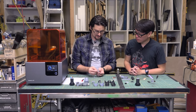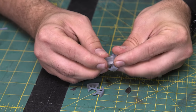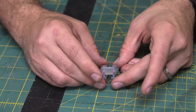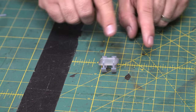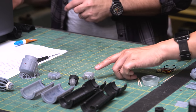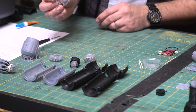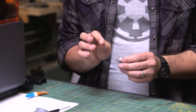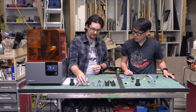The other one has these little crystal clamps. I would like to actually make those a little tighter, but they just kind of slide on. You put a little dab of glue, set it down on the tabletop so that you can align them correctly. It doesn't matter where you position them as long as they're somewhere on the crystal and holding it. That will be the crystal that mounts above the focus crystal. I mean, it's amazing, you're modeling not only the crystal, but the perfect clamp system. Yeah, and they slid right on, so that's the finished one, all glued. I use super glue on it. If you went through the effort of polishing this, you may want to use something like Elmer's because the super glue can haze. But I didn't get much hazing on this, so it turned out pretty good. You only need a little dab.